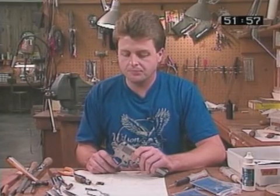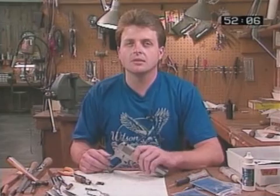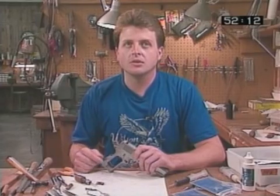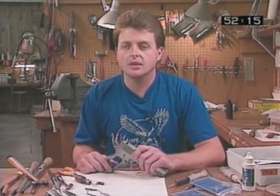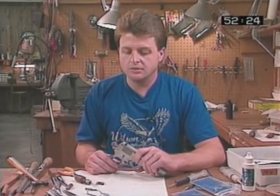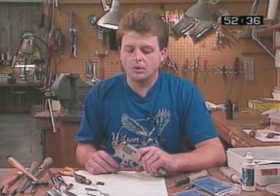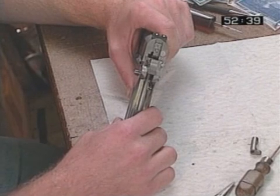The same goes for the legs on the bottom of the sear. If the legs aren't square there, when you pull the trigger back, your sear is being pushed from one corner and not both sides at the same time, and then you'll end up with it trying to creep. Anything like that will always cause creep. The same way with your hammer hook contact. If only one side engages, then usually it'll always make it heavier. It'll make it a lot heavier than it will with two. Oh, really? It doesn't seem like it would, but if you've got both hooks with full contact, it'll actually improve the weight of it.